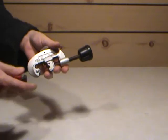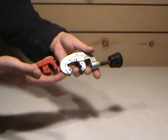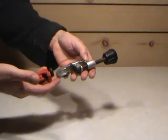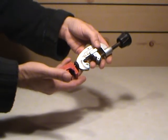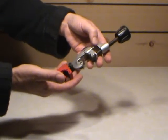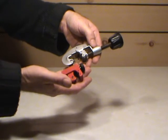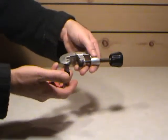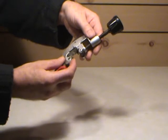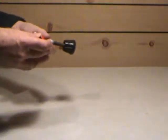A little later I'll be showing you how to cut tubing — copper tubing, steel tubing. These are the most commonly used ones — there's a big one and a little one. They use them for cutting plumbing pipe like copper pipe. The small one will do right down to small stuff for automotive work — brake lines or whatever, you can cut steel with it. Never use copper on your brake lines, always use steel for automotive applications. For the house you use copper, unless you're using the newer plastic stuff. All you do is turn the handle and crank it down as you're turning — there's a little wheel with a sharp edge, much like a can opener — and you just keep going around until that piece of pipe falls off.